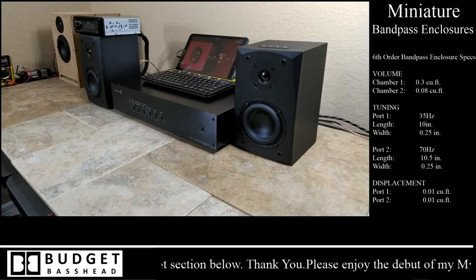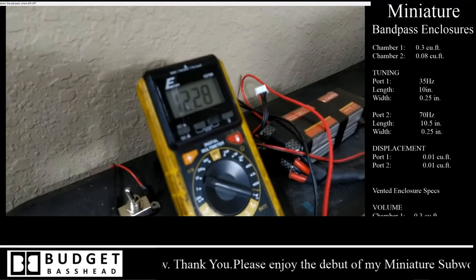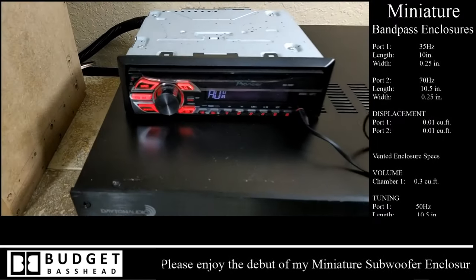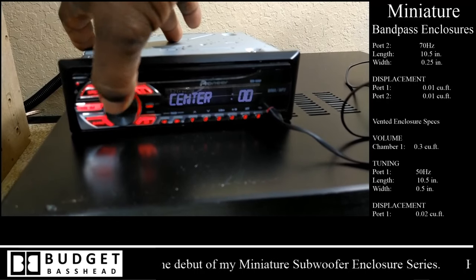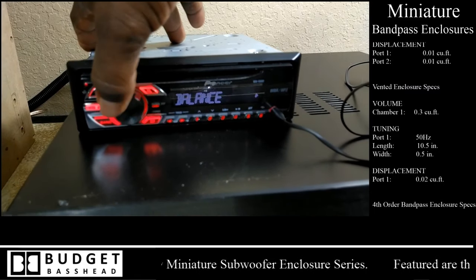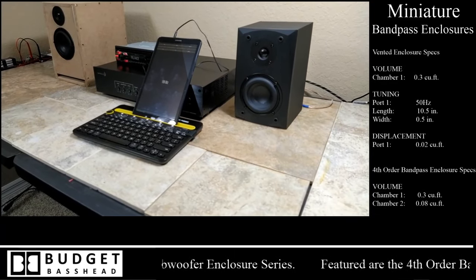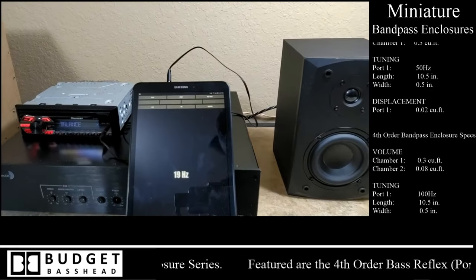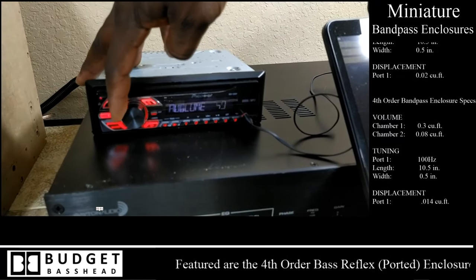But what I'm going to be doing for the test itself is I'm actually going to be running it from the car stereo. So I'm checking my voltage here, which we're good. We're above 12. And I'm going to be running it from here, and I'm going to be doing a left and right. On the left is the bass reflex enclosure you guys just saw me do. And on the right is going to be that passive speaker, that non-powered one is what you're going to be seeing on the right. Okay? So this is not under its own power. This is going to be a bass sweep from 150 all the way down to 20 hertz for the guy on the left.